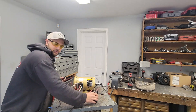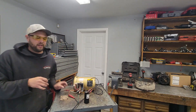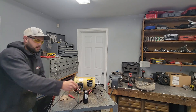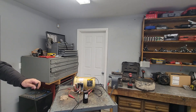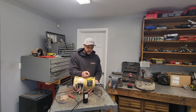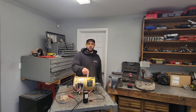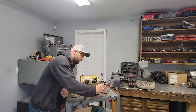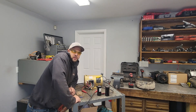Okay, I'm so far from the breaker — let me try it. We're running! It didn't take off right away though. There's actually a calculation for what cap size you need. I looked it up: it's 67 microfarads per horsepower for a single-phase motor. I don't know what you need for a three-phase motor.